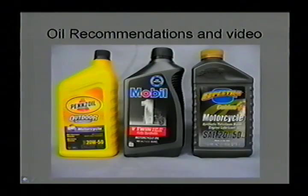The full synthetic oils do not work well with Avgas — you can use a little bit of Avgas with it, but we don't recommend a lot of Avgas use with the full synthetics. The full synthetic does give you that 100-hour oil change interval, or once a year whichever comes first, if you're using mostly unleaded fuel. Golden Spectro makes a semi-synthetic that can work with Avgas or Autogas, also a quite good product, available in 10W40 and 20W50 weights.